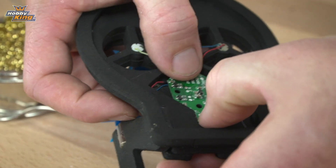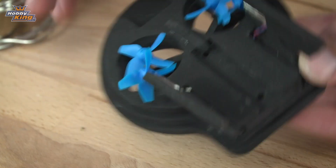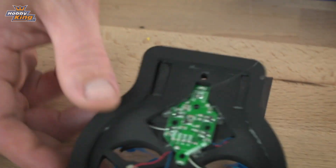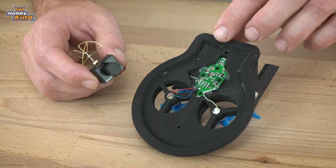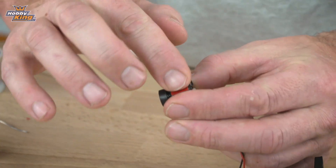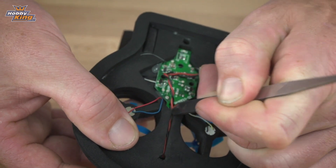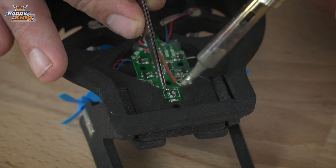The circuit board goes in upside down so that it's the right way up when the hovercraft is the right way up, and we're going to use a little bit of hot glue. When hot gluing the board in place, just put a few dots of glue around the edges — it'll be a lot easier to get back out should you ever want to change something. The next step is to install the camera into the frame. Apply some double-sided tape to the bottom of the camera, push the wire through the hole in the bottom of the frame, run it back along the slot, and cut it off at a length where you can solder it to the power pads on the flight controller.